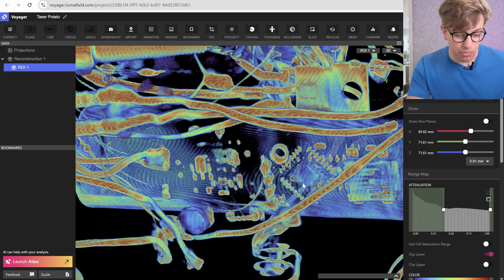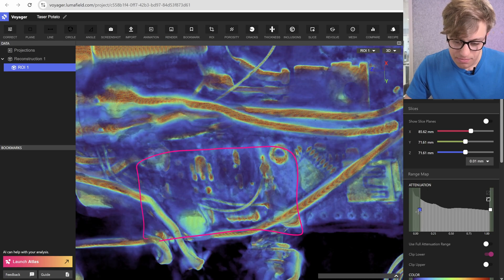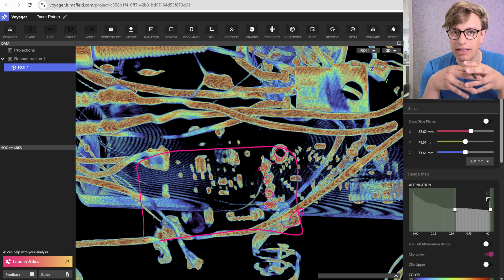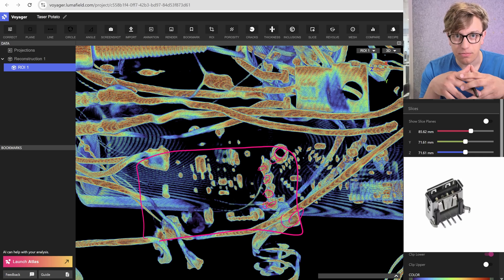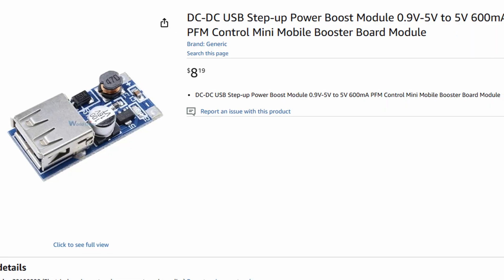This extra circuit board here, which you can kind of see the outline of — that's actually a power converter. What that's doing is it's taking our single lithium-ion cell and boosting it up to 5 volts. You can see these four pins and these two mounting holes, arranged in a way that really looks like a USB Type-A connector. This would be the circuit board to just make a USB battery bank — you can buy those just off the shelf, and I bet that's what he used.